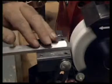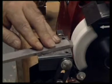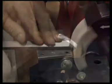To sharpen the hardwood scraper, use a diamond hone on the front edge, just as we did earlier with the Easy Beader, or, if damage has occurred, present the bevel to a grinder at 80 degrees. By turning the handle slightly to the left and right, the curved profile will be maintained.